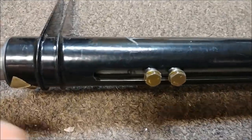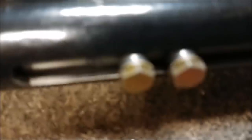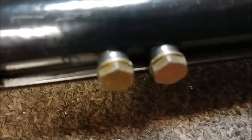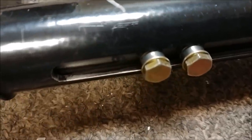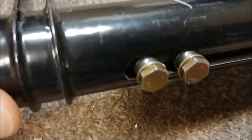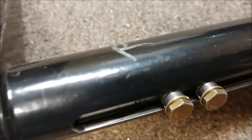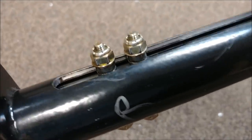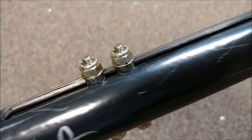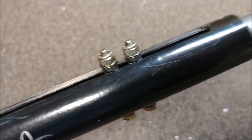On the side sticks – as I may have mentioned at the open house – I wasn't happy with the action on the sliders because we just had 4130 steel blocks running in that slot, and they were binding a little bit. So I switched them out to bearings I had ordered earlier. There are four bearings total, two on each bolt, same on the opposite side. With a little adjustment, it's running really smoothly now. There may be some opportunity to improve that further for production, but it's one of those things you try out on the prototype and improve moving forward.